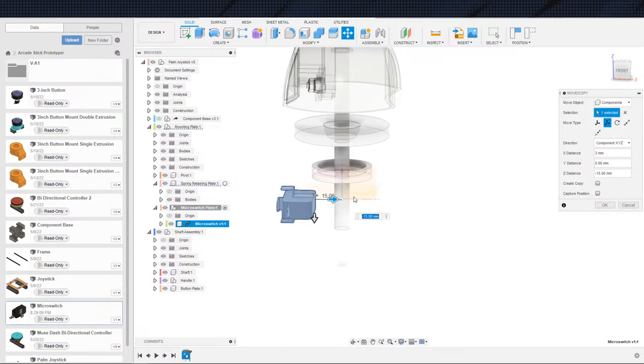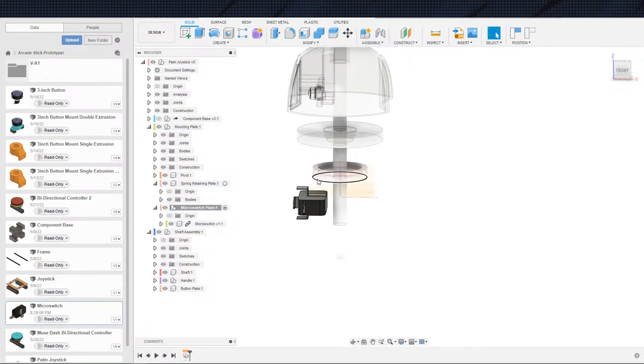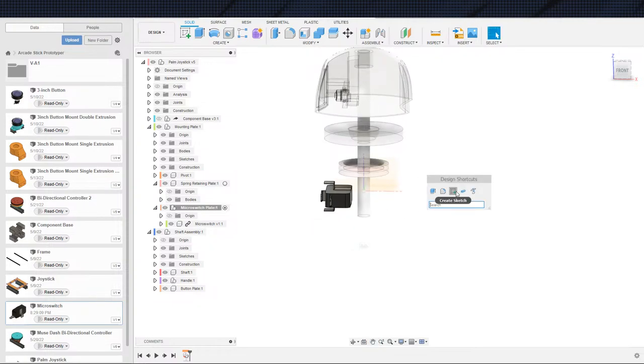And let us start out with 5 is too little, right? Yeah, so 5 is too little because we have an 8mm shaft. I'm pretty sure this is 8mm if I recall correctly. So that's only 1mm past the shaft. So let's do minus 4. Again, this is going to dictate the minimum throw we have. So let's do just another 4 to start out with. And then we can, again, adjust this out on the plate. So we can now start drawing the plate.